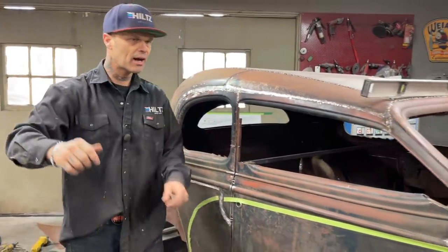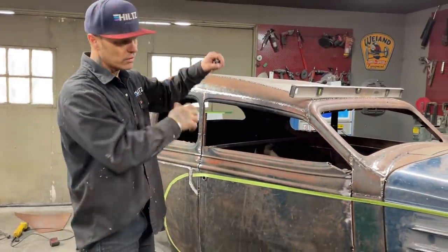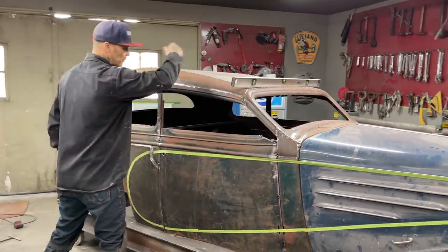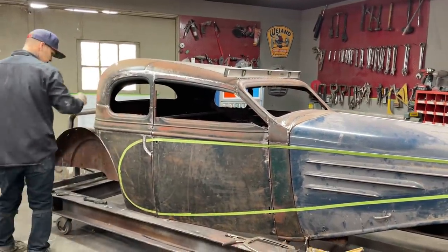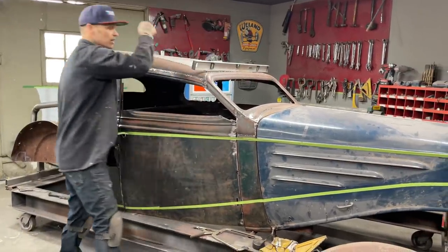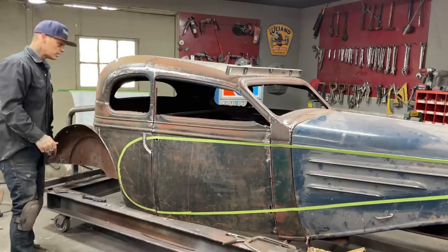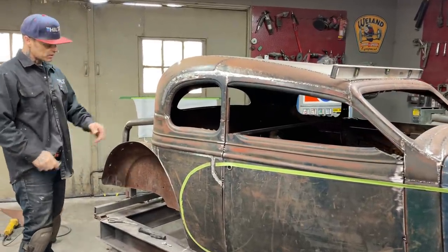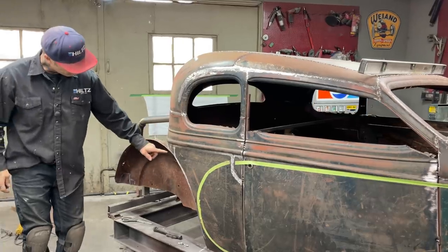It's almost like painting a car. When you paint the front fender and you go to the roof and whatever, when you go back in, you do the exact same process. So I find a process, and I weld it, and then I come back to the end and I start over again. It's one spot at a time. I do not lay beads on the car whatsoever. Do not lay beads on the car. I spot it up one spot at a time.